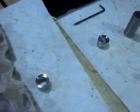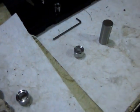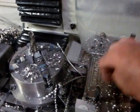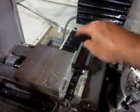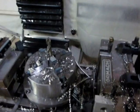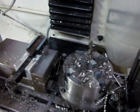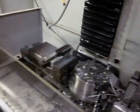I needed to make these parts and I don't have a CNC lathe, but if I can use my mill to make them I'd like that. One other note worth mentioning: I don't have a tool changer on this machine, so normally for multi-tool operations I've got to manually load each tool. But in a case like this where I can just mount my tools on the table, I can just go ahead and run these parts. As long as I don't get any tooling failures, I have time to cut the bar and put the little side hole in that lets me control the height of the part.